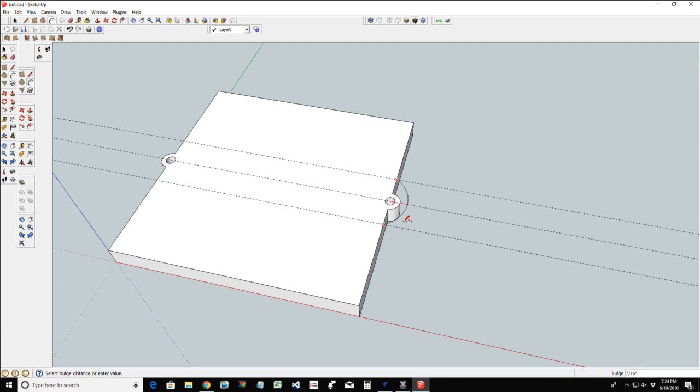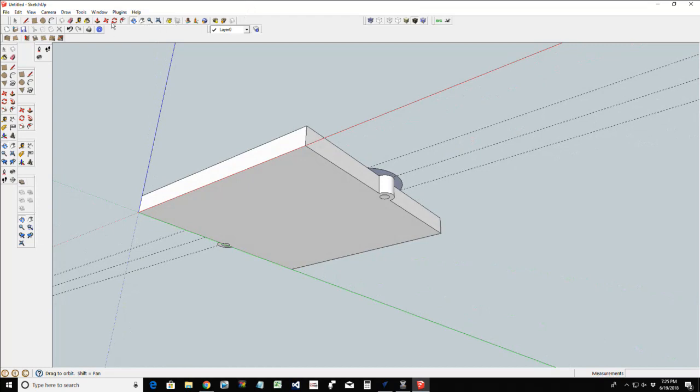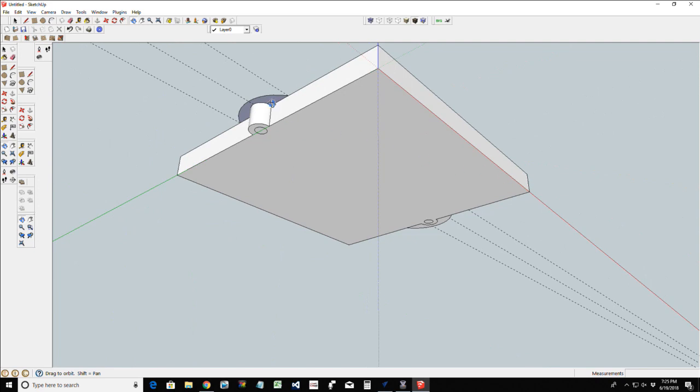I'm just going to create a nice little arc here, and on that bulge, let's see here, what would be a nice subtle distance. Let's go 3/8, 0.375. Okay, and same thing here, line arc to 0.375. Wonderful. Now I want to go ahead and push pull these tools here. Let's push this down and snap it into there. Let's spin this around and do the same thing with this surface. Let's snap it to there.